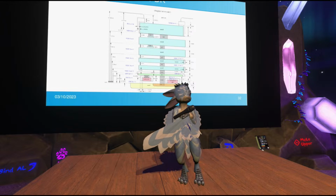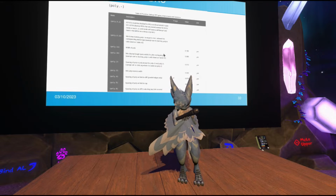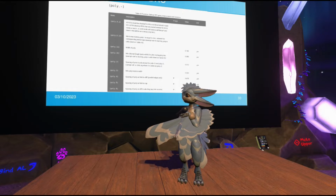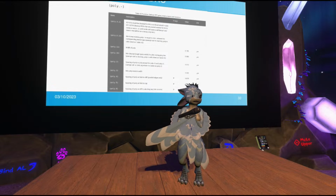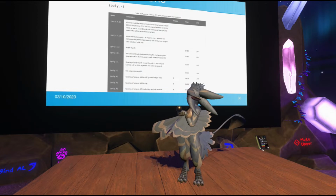To further document the actual capabilities of the fab, they provide something called a design rule check, or a set of design rule checks. If you've ever used KiCad before to make PCBs, you know roughly what these are. It's just a series of rules that you can't break when it comes to your feature sizes or distances between features. And they have these for every single layer. There's a lot of them. This is for the polysilicon layer, and you have a rule in there, for instance, width of poly, 0.15 micrometers. So it's like a minimum size for that.